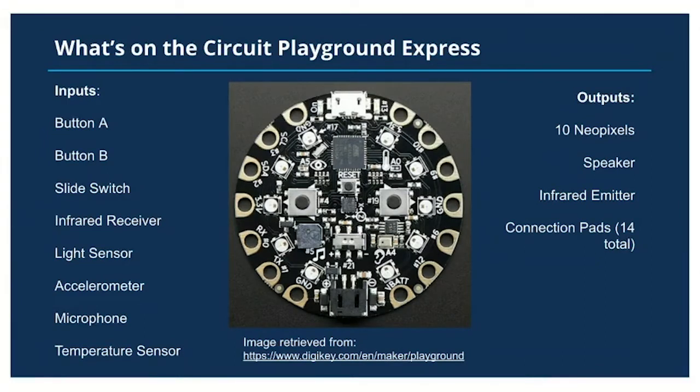There are also outputs built into this board. There are 10 neopixels — special electrical components consisting of RGB LEDs (red, green, and blue). They are programmed through a data signal that tells each pixel how bright to be, on a scale of 0 to 255. That value equates to a color, so these LEDs can be blended to produce any color depending on the data the neopixels receive. There's also a speaker which can emit sounds — it's a piezoelectric speaker, so the sound quality resembles cute 8-bit synthesizer sounds.